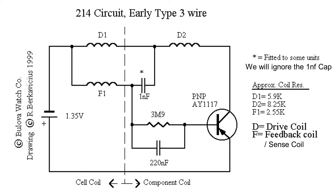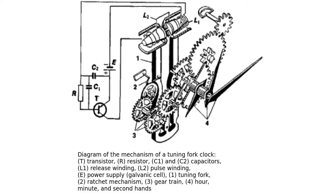The electrical diagram on its own doesn't show the whole picture. The coils on their own can't do much, at least not without the actual tuning fork. The tuning fork of this watch has two permanent magnets on it that can sit between the coils. In essence, this combo is essentially generating the 360-hertz frequency that we're hearing.